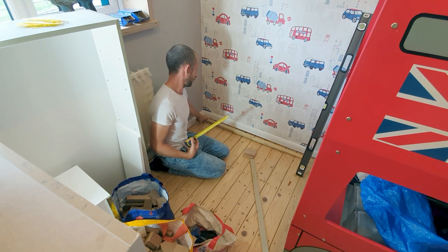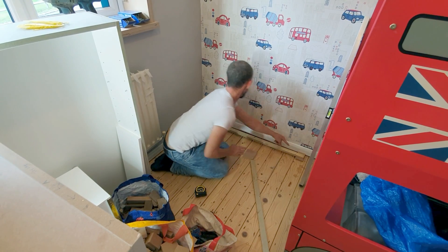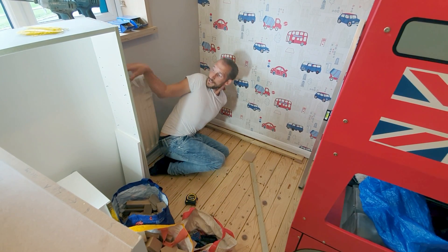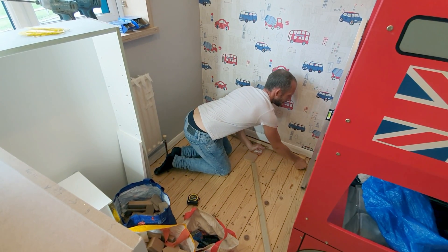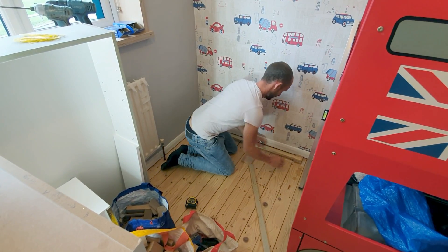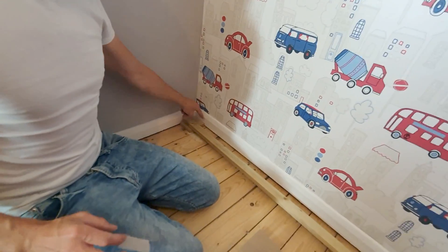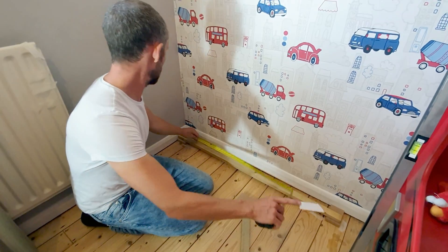That bearer will be in line — the back goes all the way up against the skirting boards. Let's measure 50 — there we go. Now let's make marks with masking tape: where the last pack is going to be, and on the front of the bearer on both sides. I don't really need to know exactly where it goes in this plane as it goes against the skirting. We've also got a 700 unit — let's measure 700 — I need a packer around this position here.